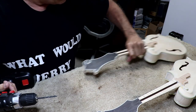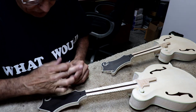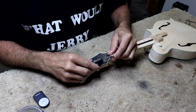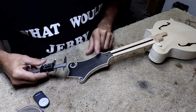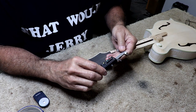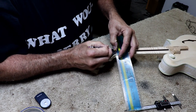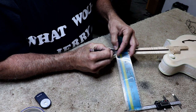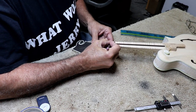That gives me room to get my Dremel in there now and start dishing this out. I wanted to mark out how long the hole is going to be, so I set the calipers at 1.325 inches — that's 33.66 millimeters. That's a little smaller than the Gibson guitar hole, and I feel like that'll probably be fine. I've got a square line drawn across there. This see-through thing I can line up with the end of the peghead and get it square, so I'll just draw it in down to about here and kind of eyeball it.